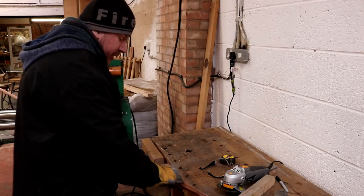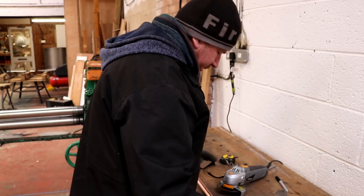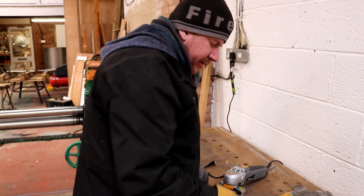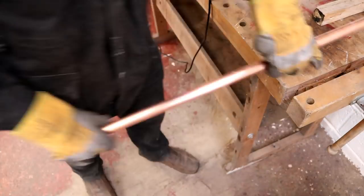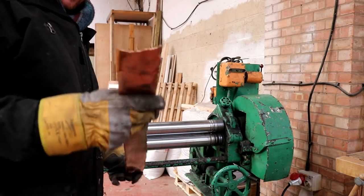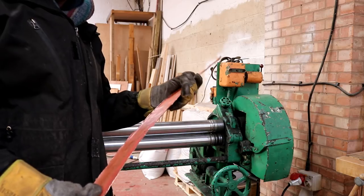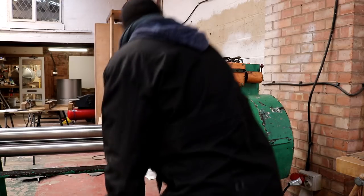Hello Screwfix, my old friend. We'll put the workbench to use right away. I need a piece of copper pipe, about 750 millimetres, flattened out to turn it into a backing bar for the weld. I've bashed her flat on the vice with the anvil section and a lump hammer and she's come out pretty good and she's flexible — I think she's going to bend nicely around the inside of that tank. That's the minimum clearance of about one millimetre.